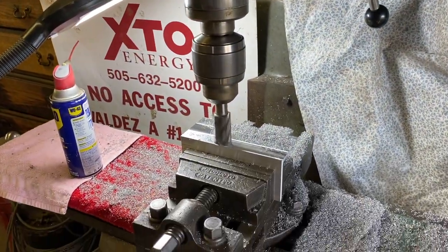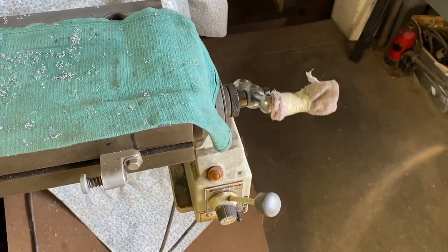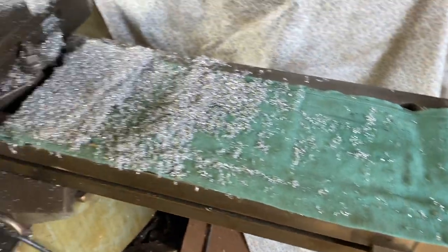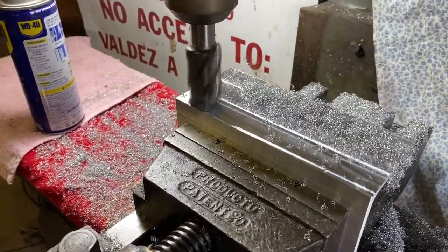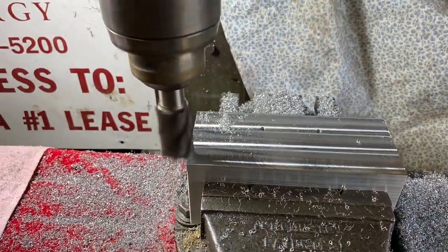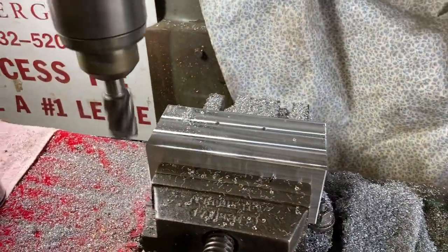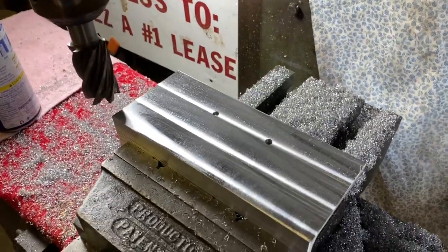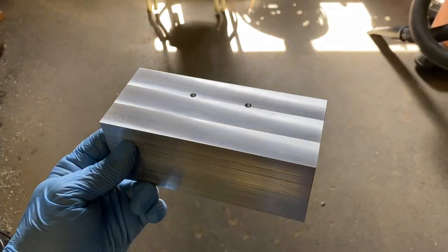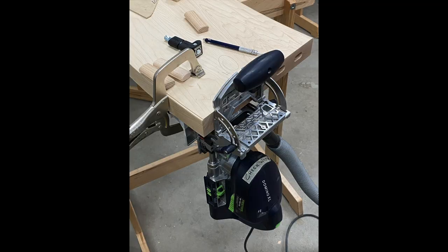Here's a bit of a side note — I'm using my dad's milling machine to create a 90-degree face. You can see the power feed my dad retrofitted. This is extruded aluminum and it's not always 90 degrees, so I had to mill one face. Running three passes worked. I know this isn't exactly woodworking, but I have access to my dad's machine shop and I love using his Bridgeport. I don't claim to be a machinist, but these are dead-on, balls-accurate 90 degrees.